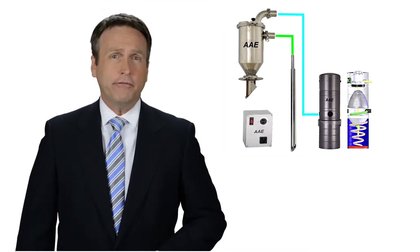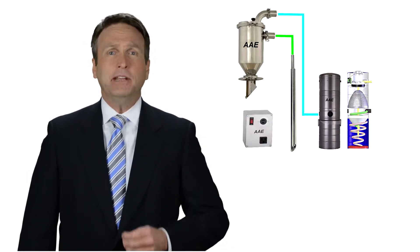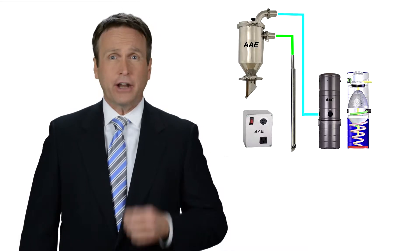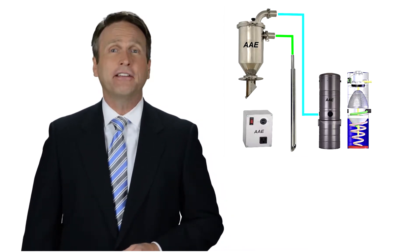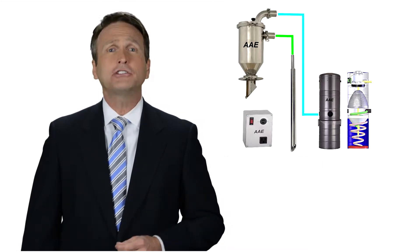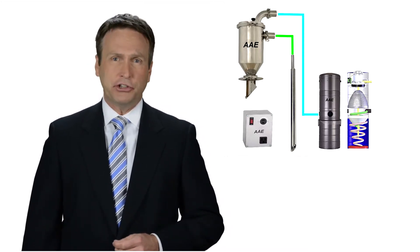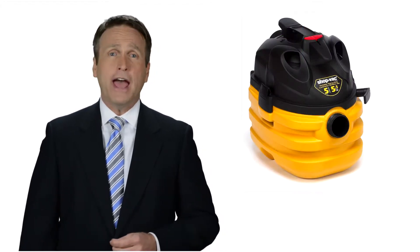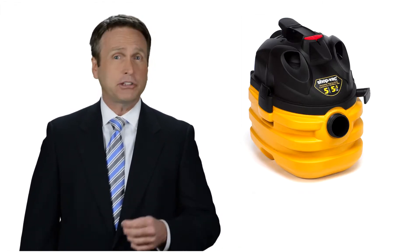Remote vacs use a floor-mounted vac and a standard vacuum receiver on the hopper. That means you can have a much larger filter and you can remove the vac from the manufacturing area for cleaning. If the vac ever fails, you can plug in a different vac before the hopper even runs out of material. For low rate applications, you can use a standard shop vac. We have many in operation for years without failure — you can buy spares at your local box store.